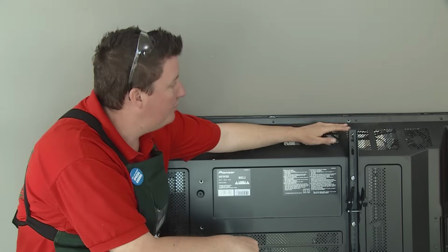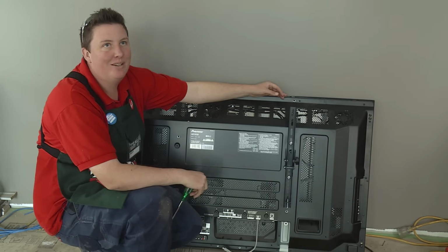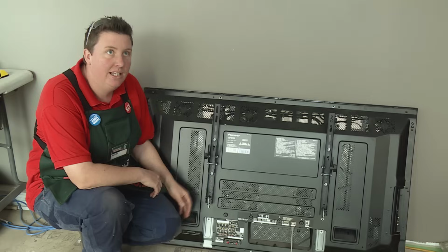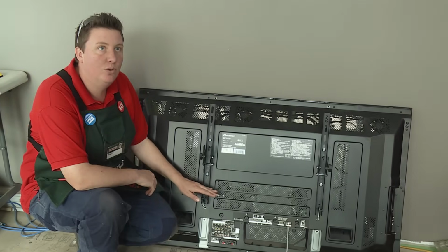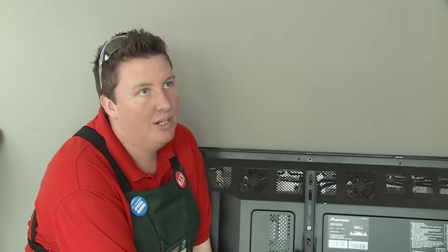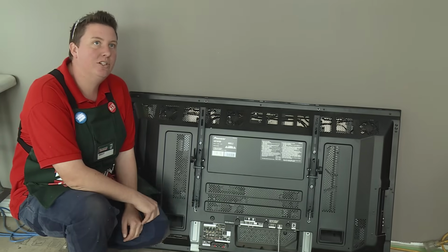As you can see, I've left the bracket just underneath the top of the TV. If you don't do that, you'll see the bracket when you hang the TV. The 2 screws that are at the bottom of the bracket are to tighten it once you set your angle and it will hold the TV in the right position. They're done after you fix it onto the bracket. They're a little bit tight, so make sure you have a nice long screwdriver to get in behind your TV.